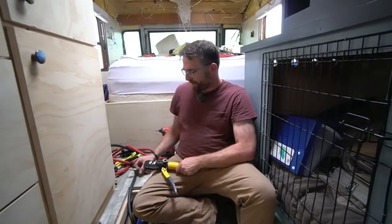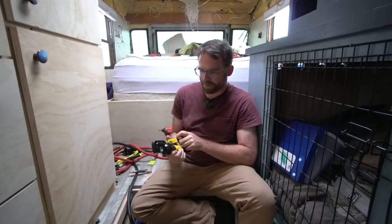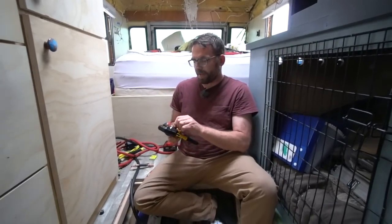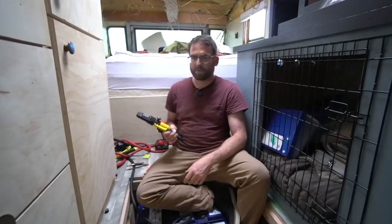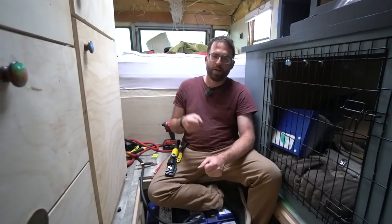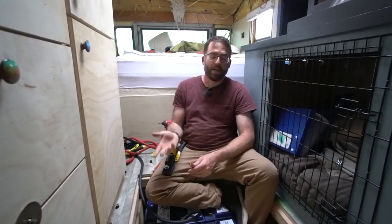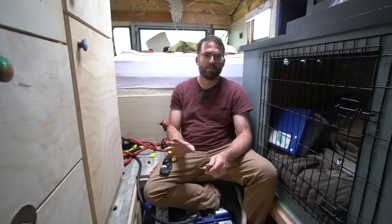I'll get my hydraulic crimper ready. Basically it's like a little tiny hydraulic jack — turn it on and pump. I think it's a 10-ton. I got it off Amazon, it was about 35-40 bucks. You can't crimp big lugs without something like this. I know there's the hammer type and some people solder. The hammering kind is effective but you don't have controlled accuracy — not everybody can do a perfect dead blow every time. As for soldering, yes it's an applicable way to do it, but what happens when solder heats up during an electrical fault? It gets hot.